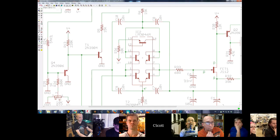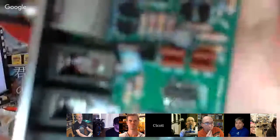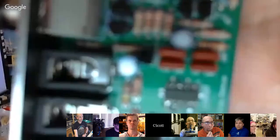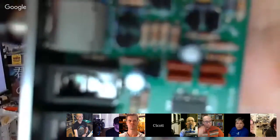All I had to do, let me flip back to me one last time here. All I had to do, and it may be tough for me to show it on the camera. Okay, you see the little hacks I did to the SMT chip? I bonded pins 1 and 2, pins 4 and 5, and pins 8, 9, and 11. I did that, and it works perfectly fine.